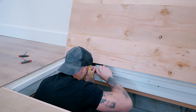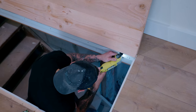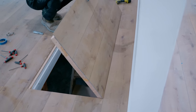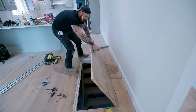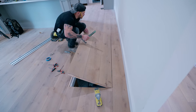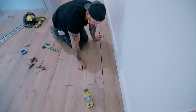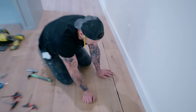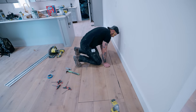After opening and closing it a bunch of times, I think the problem is this section right here is overlapping it by about an eighth of an inch. To keep it from touching, I'll have to trim that down. The downfall is it's going to create larger reveals. This section is dead perfect — I'm actually really surprised how it's laying. But after trimming the back, the good news is nothing's catching anymore. The bad news is the reveal is more than I wanted, which really sucks. I'm going to try adjusting these hinges so it pushes inward a little bit, but man, I was really getting excited this was going to be picture perfect.